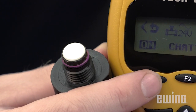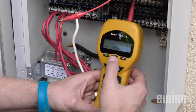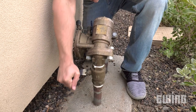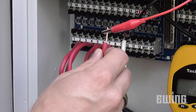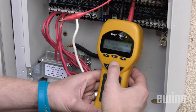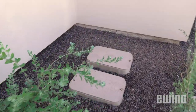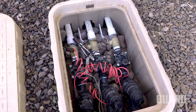In addition to being an ohmmeter, the Armada Pro 50 can be used to activate solenoids for testing purposes and can help you locate lost valves through the chatter mode. After turning off the water supply to the system, connect the leads to the common wire and the station wire for the valve you're trying to track down, then select the chatter mode function. This will trigger the solenoid to open and close once every two seconds, causing it to make a clicking sound. Now just walk the property while listening for the sound to locate your valve.